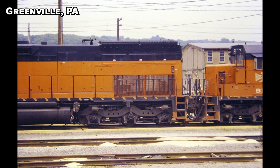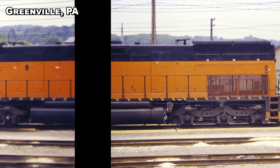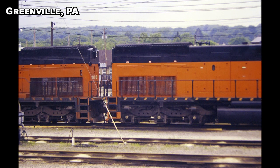The wheelbase between the center axles, often mistakenly cited as 43 feet 6 inches, was in fact 43 feet 3.5 inches. The 43 feet 6 inch dimension was for the bolster centers, as the bolster on HTC trucks was offset outward by 1.25 inches from the center axle.